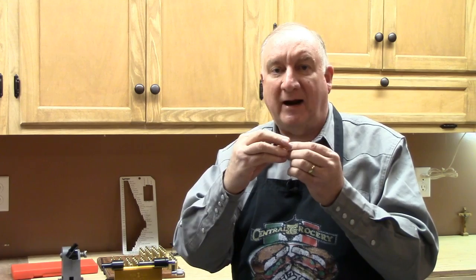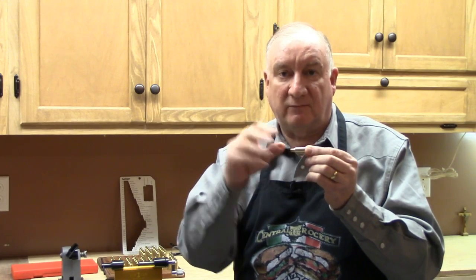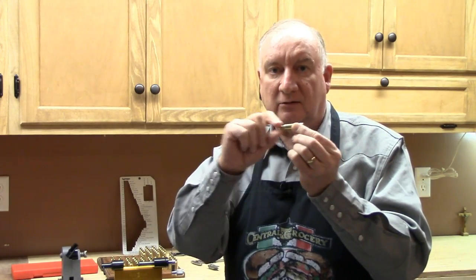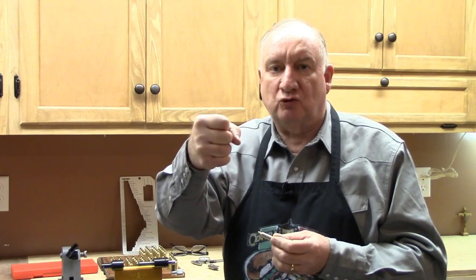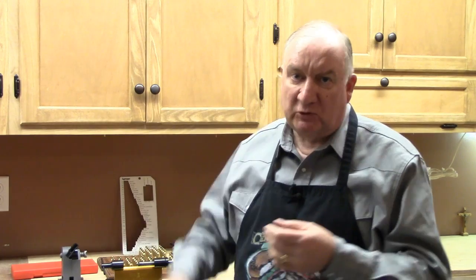The brass does, to some degree, actually flow forward like molasses, and the softer regions of the brass will actually flow into the case. But most of that growth occurs from that repeated stretching of the case and then the resizing of the case, which squeezes it like a soft tube. It squeezes it and forces that brass forward into the sizing die. So that repeated process, forcing it forward into the chamber of the rifle during firing, and the forcing of it over the expander ball, all these things act upon that brass to continually stretch it and lengthen it.